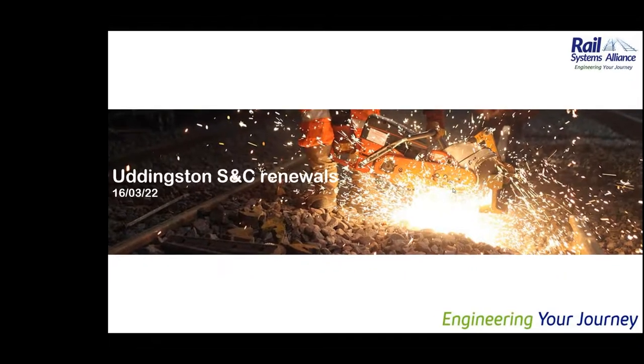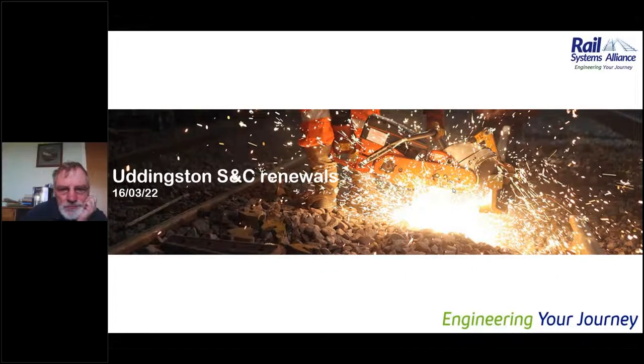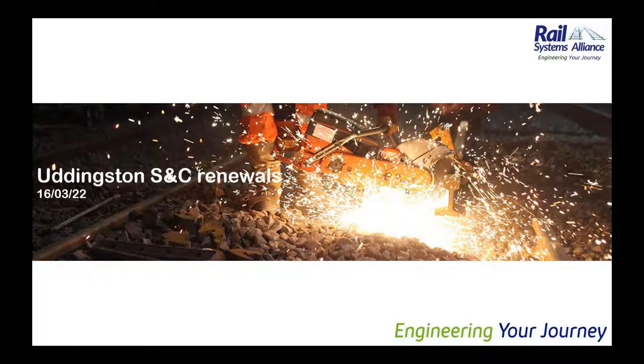Hi, good evening, everyone. Today we are here to speak about the Uddingston S&C renewals job that was carried out during the Christmas break. This is one of the complex S&C in Scotland. This was also the first installation of its type in the United Kingdom with the longest NR60 Mark II head switches, and NR60 switch diamond and Unistart being used on the main line for the first time in the UK.